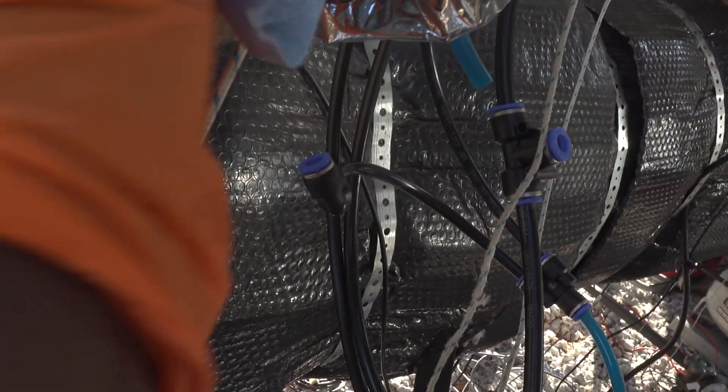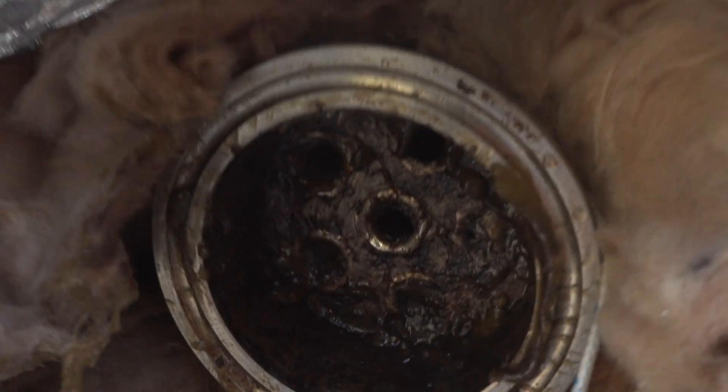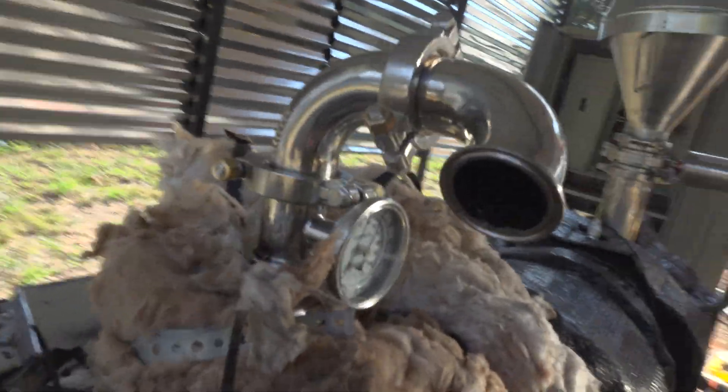I went ahead and took a look at my condensers and they were indeed clogged, but not clogged to a degree where vapors couldn't travel through — we had no problems with vapor pressure being too low in the vacuum. But the issue is the vapors look waxy, so we are getting hydrocarbon oils clearly, but these hydrocarbon oils are not able to flow down into the sight glass. They're actually getting too cold and gumming up, waxing up in there. So I think we need fewer condensers — we've got to make the condensers shorter.